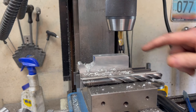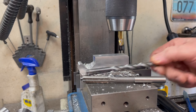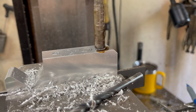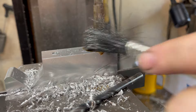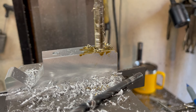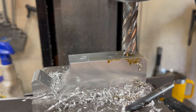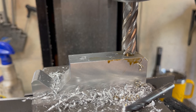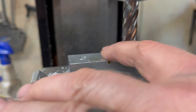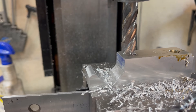The next hole will be a 10mm hole, 543 thousandths in and then 64 thousandths off-center towards this side. I'm going to drill and then use a 10mm reamer at the end. Now time for the 10mm ream. I'm still sitting above that hole so I need to move back 64 thousandths to get to the center. Now I need to mill a slot — I'm using a half-inch end mill and I'm going to make it 2.2 inches deep, going to that little circle I marked out before.